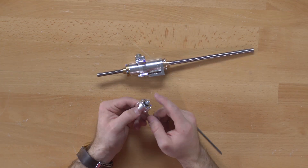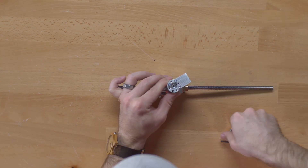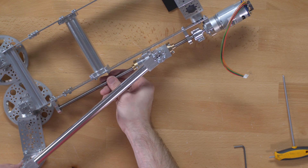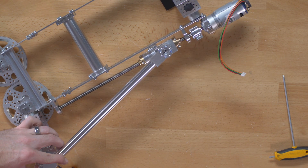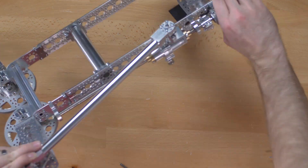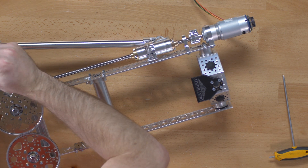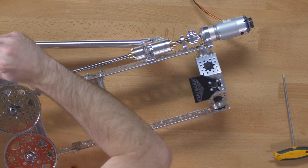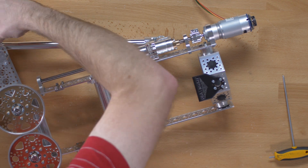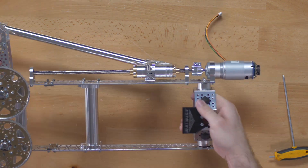When you have an assembly on a single lead screw, it'll have a tendency to want to rotate, of course, because the lead screw is rotating. I didn't want it rotating around the lead screw. Although I could have gone with various different ways to connect from this traveling assembly to one of the fingers of the claw, I went with dual ball bearing hubs because they're very strong, and I know that this particular setup is going to restrict rotation — so it's only moving along one plane. If you went with something else, like a ball linkage with a threaded rod connecting them, that would allow rotation more than you really want, and this traveling assembly would twist and hit this pattern plate along here.